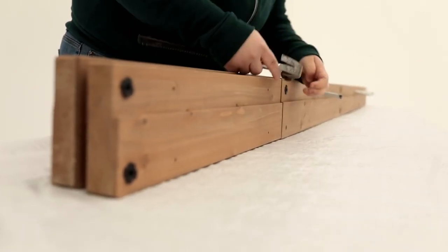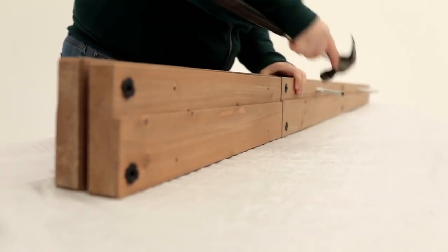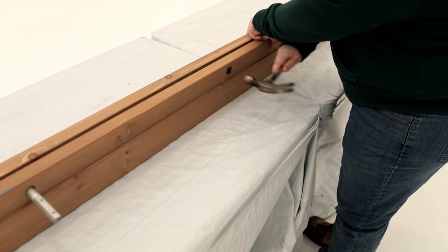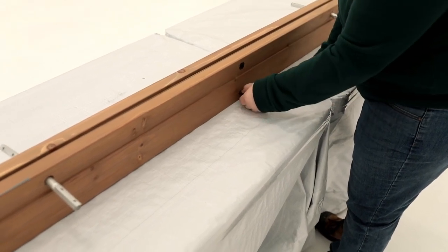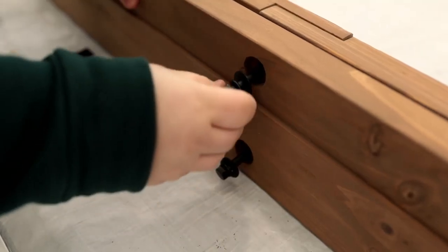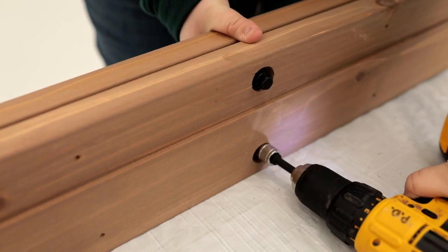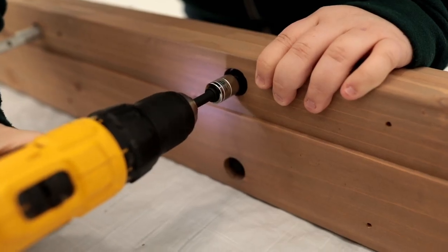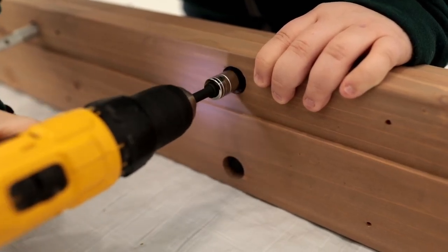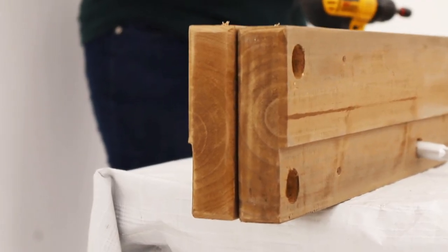In the non-countersink holes in the middle long beam, middle short beam and middle beam assembly A, install T-nuts, then loosely attach the assemblies using the 6 middle countersink holes. It is important to note that 4 hex bolts are installed through the middle countersink holes in the middle beam A assembly and 2 through the countersink holes in the middle long beam. The bolt holes on the end of each assembly should remain open for now.